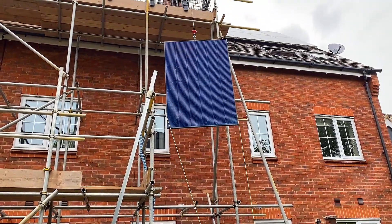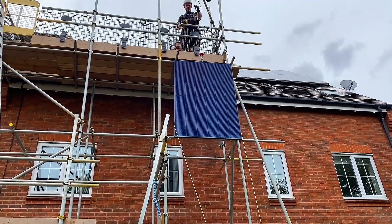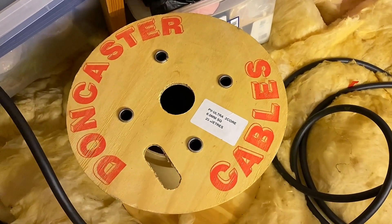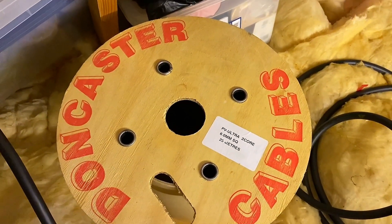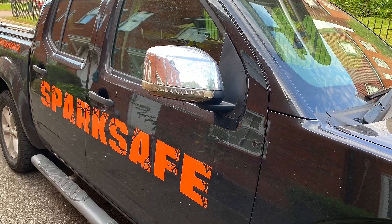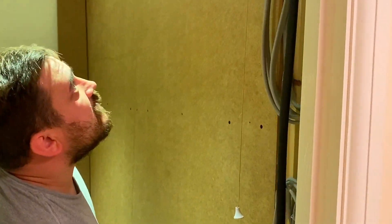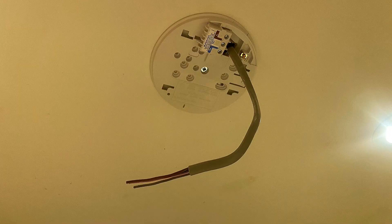For what I thought was my last cable, I bounced up to the third floor — which reminds me, I forgot to mention to Sean on the phone that I was in a three-story house before he came to do the installation. I thought it'd be a nice surprise when he arrived. We decided to take our cables as strings using Doncaster PV Ultra cable, which comes in two and four core and in 4mm and 6mm. I selected the 6mm² two-core version, which ran from the roof space all the way down to my SunSynk inverter.